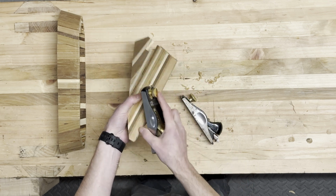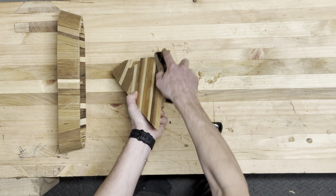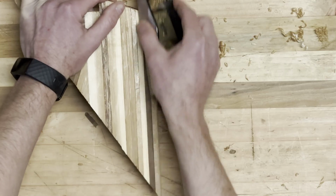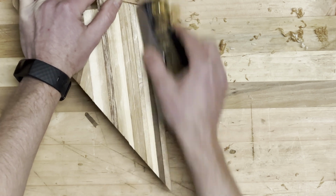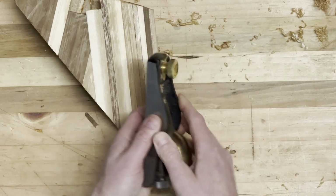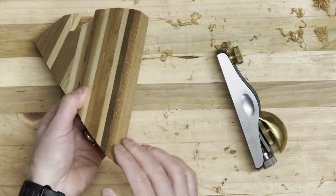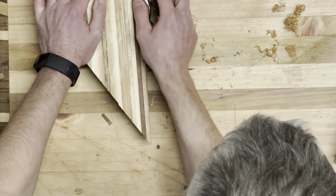And chamfer, this is called chamfering, where I have a pronounced edge to the work, and all I do is take the plane and just remove the sharp edge. And the advantage of the block plane over a sanding board or a chisel is you can control the cut very precisely. And in many cases, you don't even require sandpaper.